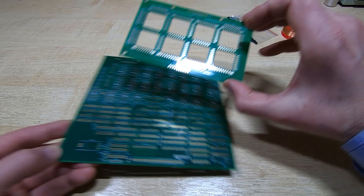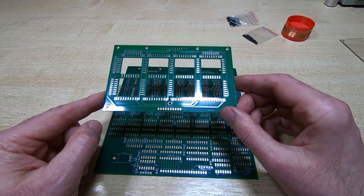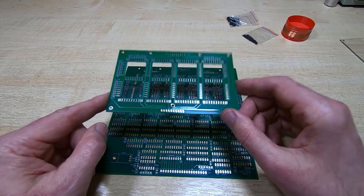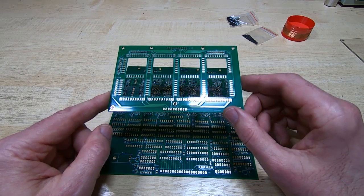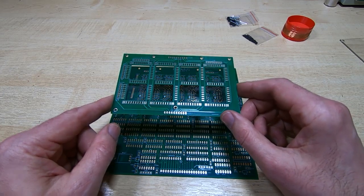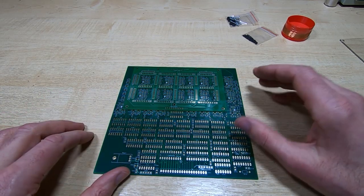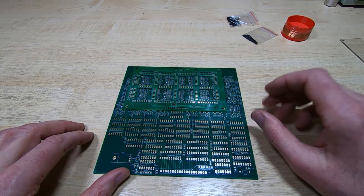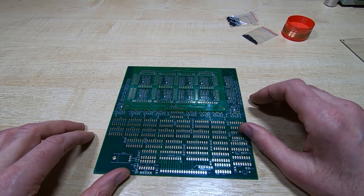In particular, with the array board, it's a bit fiddly to assemble, and you almost certainly will need a microscope — I certainly did. One of the things I wanted to briefly look at before I finish is the type of wire that's used. If you decide to source your own wire, I recommend using what's referred to as solderable wire. So we'll go over to the microscope and try soldering two types of enameled wire — the solderable type and the normal type — and we'll see the difference.